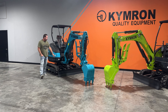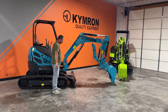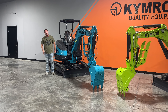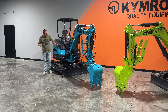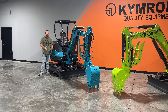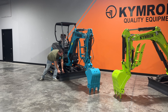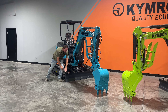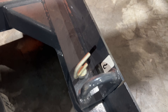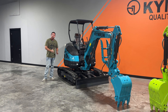As we move back here you'll notice the extra wide chassis on this one, and that's because we have the tracks retracted outward. This model actually has retractable tracks that you can move in and out, so you can squeeze through narrower spaces with this big machine. You'll also notice down here the blades that break loose — there's a pin here you just pull it out and fold them back. Makes it nice and handy when those tracks are in, then your blade matches your track width.